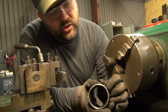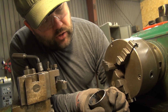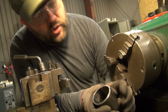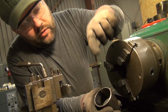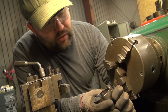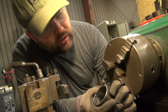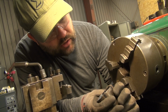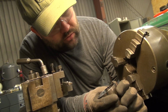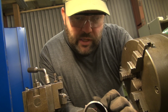centimeters in that direction. What seems to have happened is that whatever solder material was deposited inside this copper tube flowed along the length of the tube, as we could see earlier, and it simply left a cavity, but still with a very good soldering connection to the test tube. So both of these methods look pretty useful. I'm quite happy with both of them.